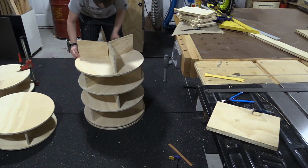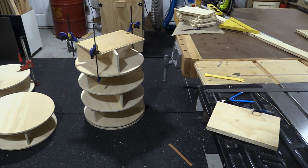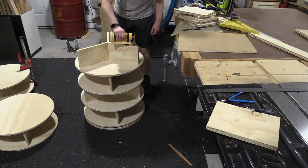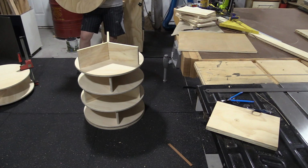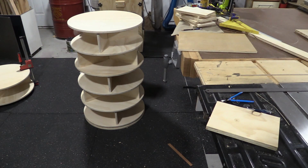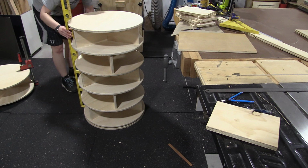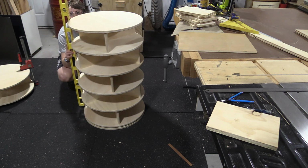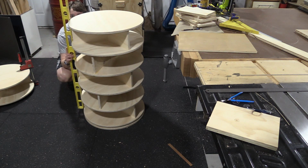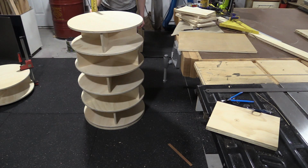This time I decided, once I got the three pieces of dividers in, to actually clamp a board above it and let the bottom part set up a little bit before I put the top part on, because this was getting bigger and now I have a base that moves a little bit more, I wanted to make sure that I was doing a good job of keeping everything square and all of the edges level. I will say that every level became exponentially more stressful than the level before. I personally would probably only want to build one that was about six layers tall in the future.